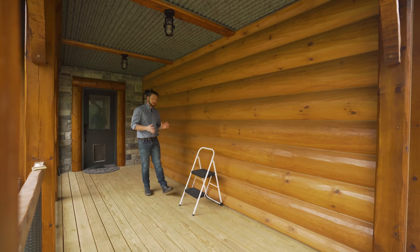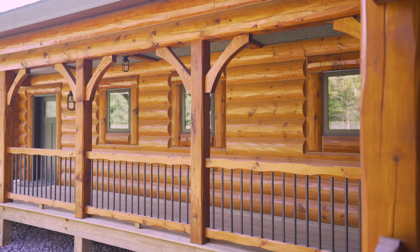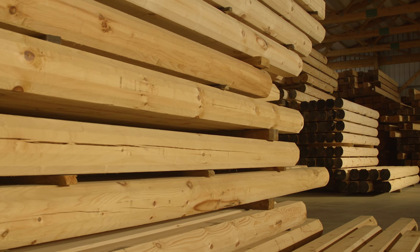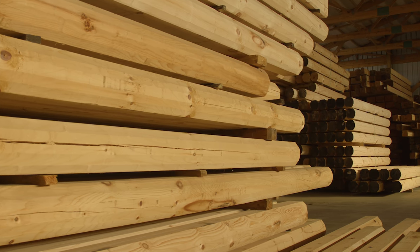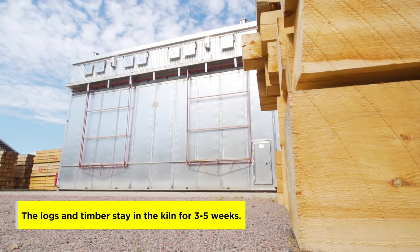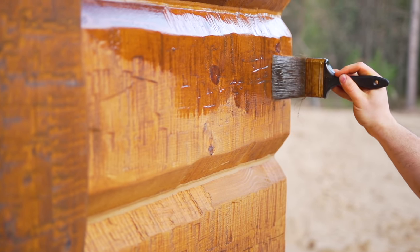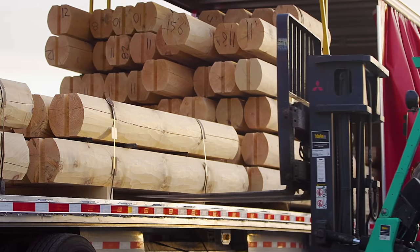When it came to staining the home, it was very convenient to just simply go around the house with a simple step stool — it made it really easy to reach up into these areas. I see it all the time where high-quality stains really outperform when they're applied to kiln-dried logs. A kiln-dried log is much more dry and porous than an air-dried log. That's because when that log is in the kiln, the heat causes the cell membrane to break open and releases the bound water. That allows the stain to penetrate and bond to the wood much better over a long period of time. It's for that reason that I consider our logs to be more maintenance-free than other log homes. We have a terrific video linked in the description that goes into the additional benefits of our kiln drying process.